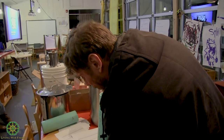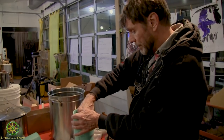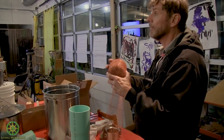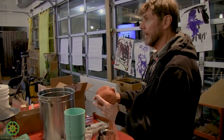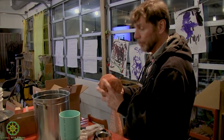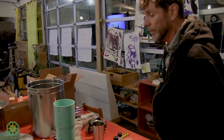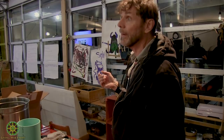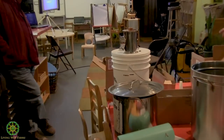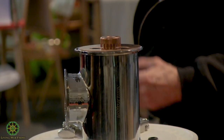I think this is a company called Mile High Distilling in Colorado — they sell the packing and the copper mesh. It's a much less expensive and easier-to-build type of column than the bubble plate design. The only problem, as you can imagine, is that anything with stuff in it — like mash with grain — has an extremely high probability of clogging this packing. So you cannot run raw mash through this type of still; it has to be strained first with all solids removed, pumping only liquid through it.